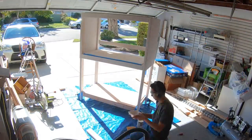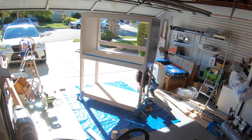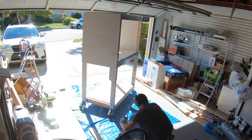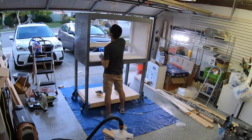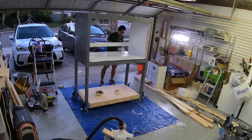I belt sanded most of the surfaces to 120 grit, primed the enclosure, and chased everything with a 220-grit random orbit sanding. To do this right, I would need multiple coats to really hide all the evidence of the wood grain, but as long as I ended up with a uniform color, I would be satisfied. There are too many gaps in this enclosure for it to actually transcend its frugal origins — painting this was really just putting lipstick on a pig.